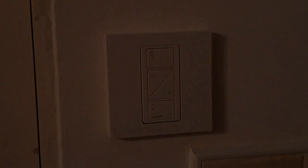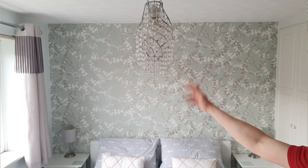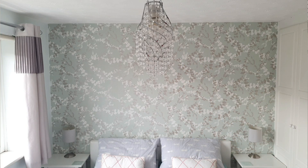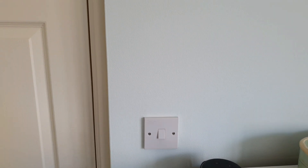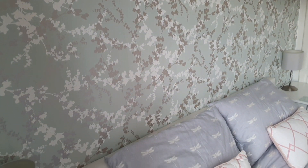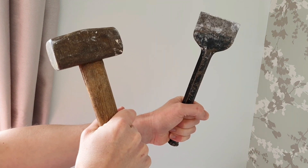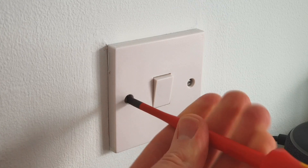Here we've got a typical bedroom and the customer wants to be able to turn the centre light on and off from the bed. Traditionally we'd need to try and get a new three-core and CPC up the wall from the original switch to either a pull cord over the bed — which let's face it looks a bit lame — or bring it down to a switch on the wall somewhere. Again, either lots of frustrating fishing or messy chopping in. So what's the alternative?